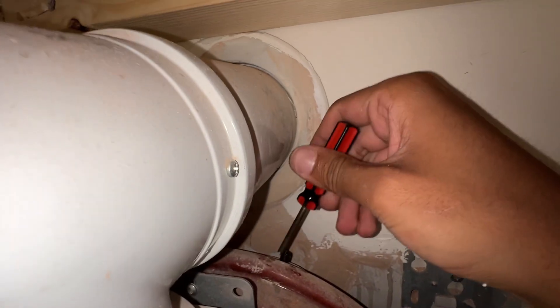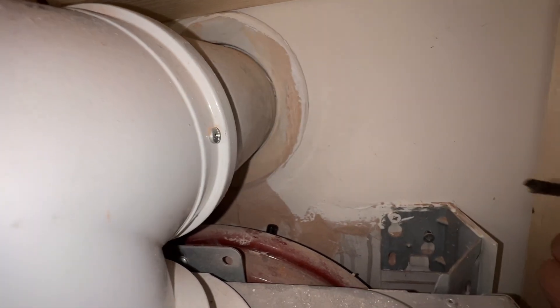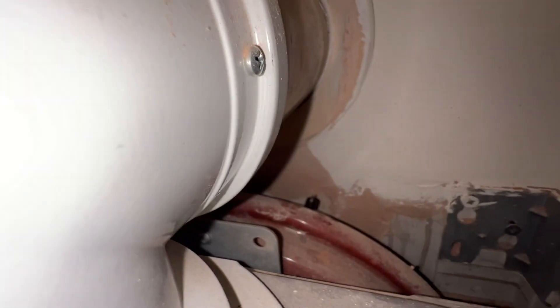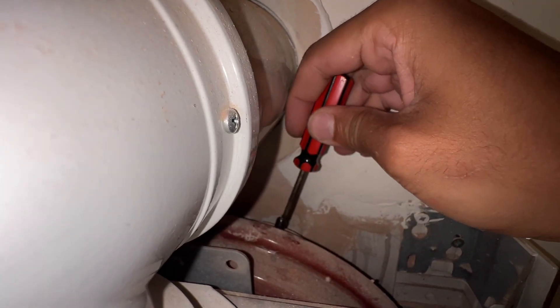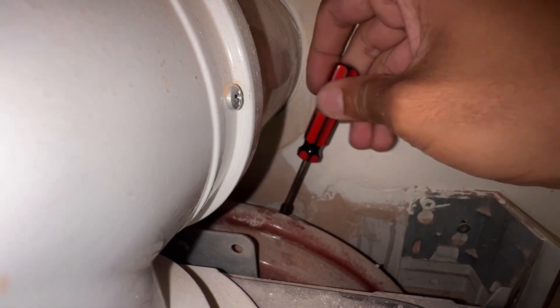What I like to do is when I'm draining the boiler down, remove the Schrader core here. I'll just remove it with that tool — it's fallen down there somewhere — and just replace it with another one. Sometimes I put a bit of silicone grease on it to lubricate this little spindle, but if I can take it out and remove it, I'll always just take it out.